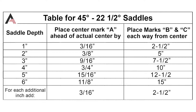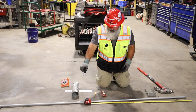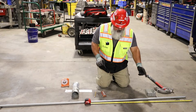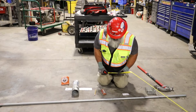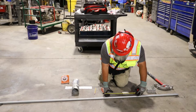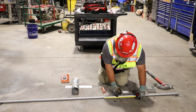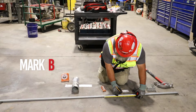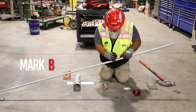For our three different bends at four inches, we're going to have a 10-inch measurement referenced from A. From A, we go 10 inches one way, and 10 inches the other way. Those are going to be our marks B and C. Starting from A, we go back 10 inches and place a mark, making it all the way around the pipe.